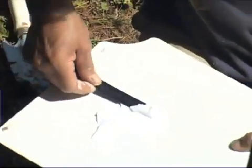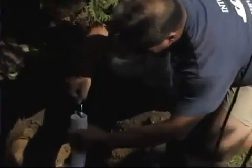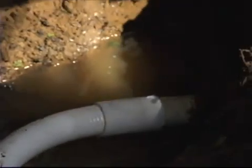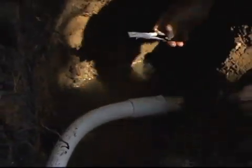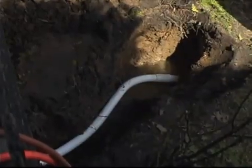It's key to make sure that it's mixed properly and thoroughly. We're going to take this and spread it like peanut butter right inside our joint — just butter it right in there. Make sure it's all the way around inside the prep joint 360 degrees. Now we can take this right down here in the dirt and mud in the ditch on our already wiped-off pipe and make this joint right in the ditch. Slide the joint right on. If I have some left over, I know that joint is sound — it's all the way up inside the female coupling and on the pipe. I can swipe the leftover component on the outside and run your finger around there 360 degrees. And that's it — wait 20 minutes to let that cure and we have a solid joint.